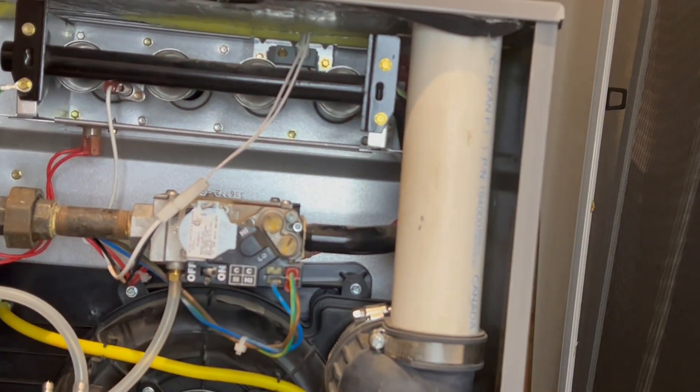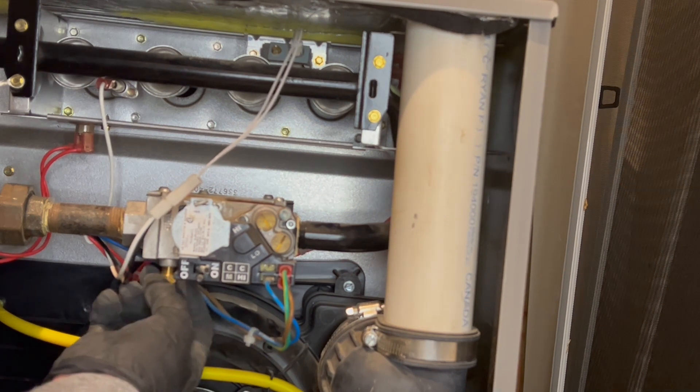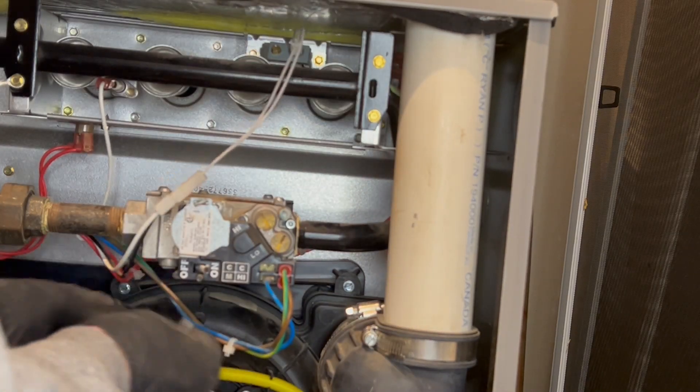If this pressure is not within the range of what your appliance rating plate is looking for, then you will have to turn up the pressure out at the gas meter regulator. This again should only be done by a trained gas fitter with a license in your area. Remove the barb adapter and return the plugging set screw.